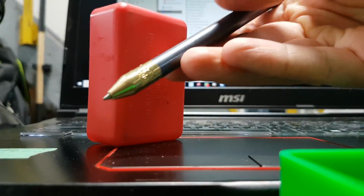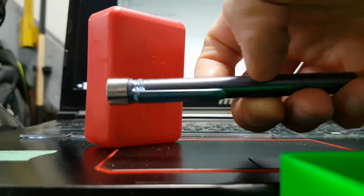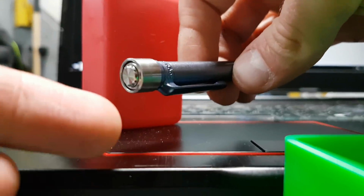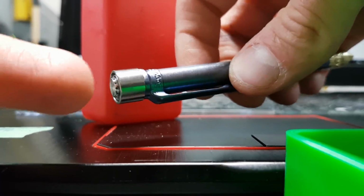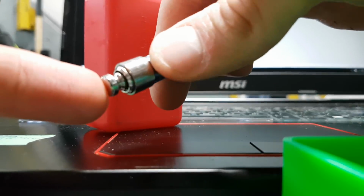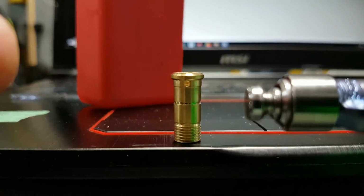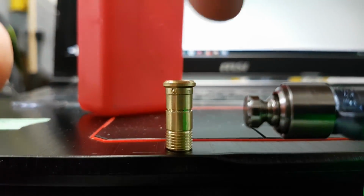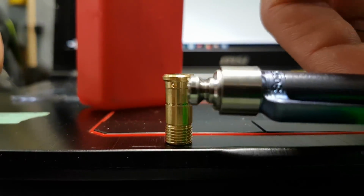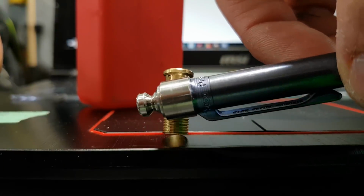We can play with colors, we can play with materials, we can do brass, copper, bronze, any color of anodizing. The button is a 17-4 stainless steel, heat treated to 45 Rockwell, and there's the threaded tube in there too. That's also stainless steel. Here is a brass version. So 2 of the components are stainless steel, the rest is titanium. Very, very awesome.